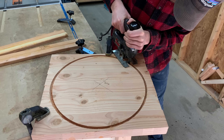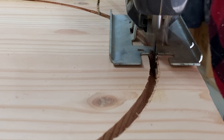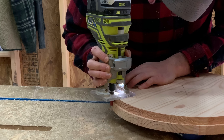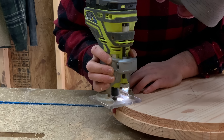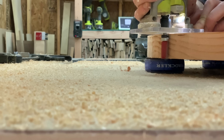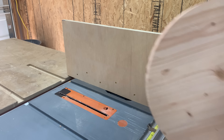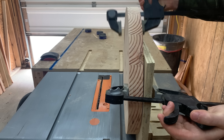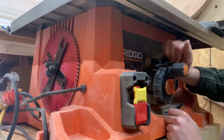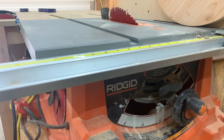Our router bit won't plunge deep enough to go all the way through this tabletop, so I grabbed the jigsaw and cut out the rest. When you do this, make sure to stay proud of the circle that was cut with the router, so you get this weird-looking tiered cake kind of thing. To clean up this edge, I used a template bit on the palm router to get a perfectly consistent circle. Because a 1.5-inch thick tabletop is not very aesthetically pleasing on a side table, I grabbed my vertical panel cutting jig and clamped down the tabletop. Just be careful — I accidentally clamped the wrong side and cut the bevel on what I wanted to be the top of the table instead of the bottom. With the blade beveled to about 30 degrees, I ran the sled through the saw to create a beveled edge.